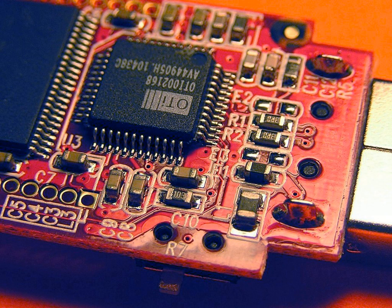Topic: Packages. Surface mount components are usually smaller than their counterparts with leads, and are designed to be handled by machines rather than by humans. The electronics industry has standardized package shapes and sizes. The leading standardization body is JEDEC. These include: the codes given in the chart below usually tell the length and width of the components in tenths of millimeters or hundredths of inches.